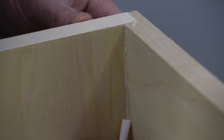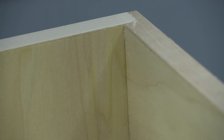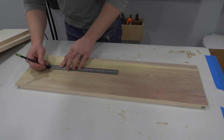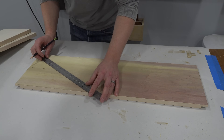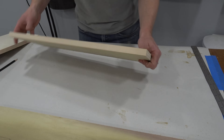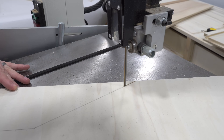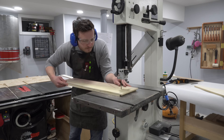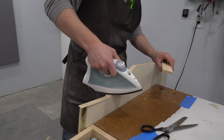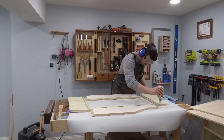Here's a pro tip: use a cheap plastic straw to get rid of glue squeeze-out on inside corners. It's kind of amazing how well this works. There are two drawers in this island which have to be a little different from the others because they will bump into the outlet boxes. To account for this, I marked and cut a notch out of those drawer pieces with my bandsaw and patched up the edge banding. I was a little worried the notch would look like a tacky band-aid fix, but I'm actually really happy with how they turned out — they look very modern and intentional.